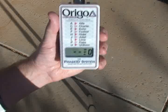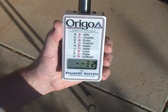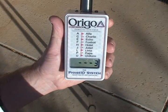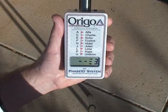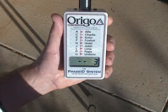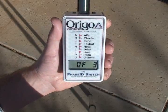What happens is, if you look at the LCD display, right now it is searching for satellites, and you have the activity indicator, which is the 2 blinking segments, and the numbers you see are the satellites that it's finding. The way GPS works is, when you first power up the module, it finds a single satellite, at least one, and then it downloads the almanac, which indicates where all the other satellites are. And so sometimes you may see that number go up quite high, 6, 7, 8, 9.